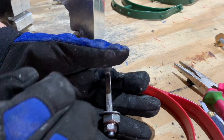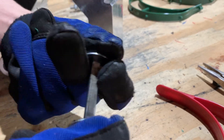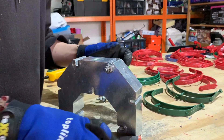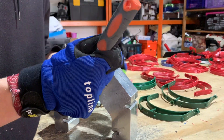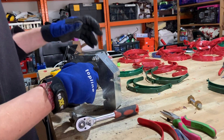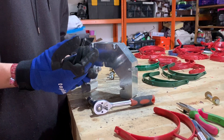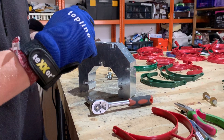To speed up the process even more, we designed these special screws — basically normal screws but with the sides filed flat, so that an 8mm screw fits into the designated place in the mold. Because it's flat, you only need one wrench to fix it instead of two. And because it's an 8mm screw instead of a 6mm one, it lasts a bit longer — if you're really making 300 a day, you'll be needing a screw set a day because the screws really get worn every time you open and close them.